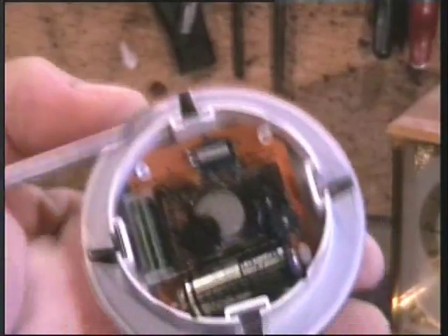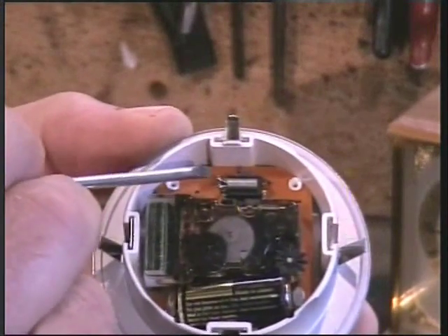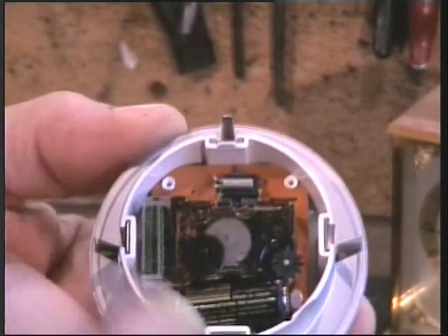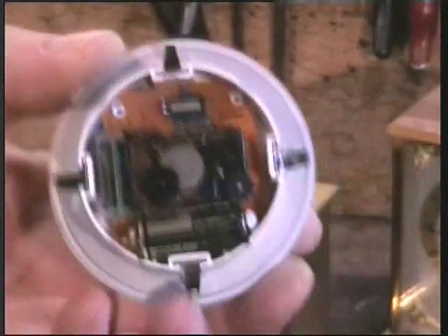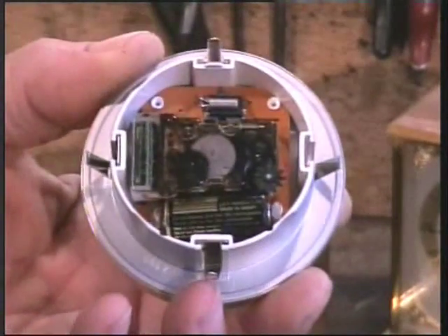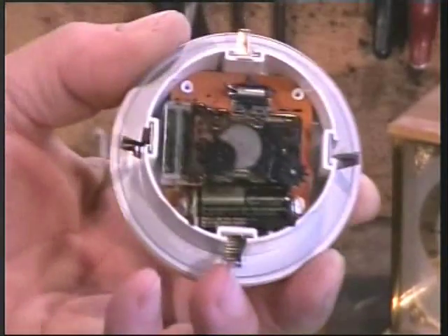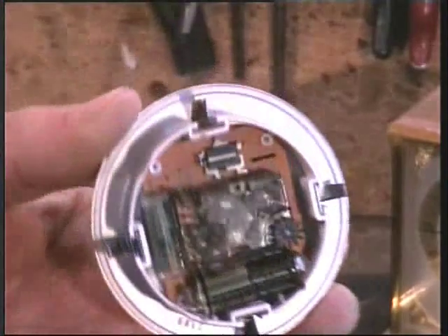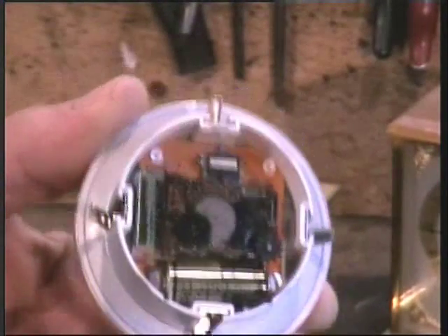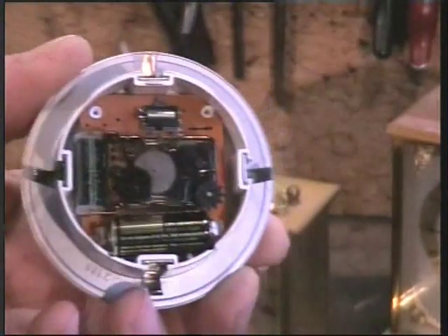What we can do is put a small padding capacitor across that quartz crystal and pull it, which is quite common practice. We are only looking at a few picofarads at the very most. It is not difficult to do but it does take an awful lot of patience to get the thing regulated right.